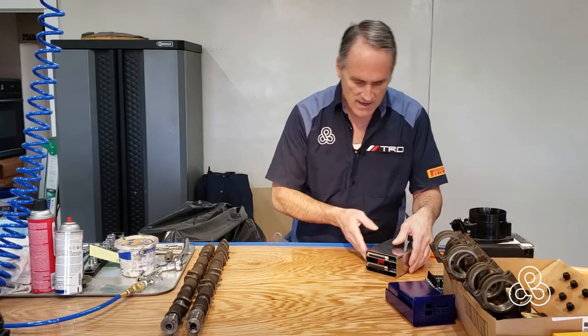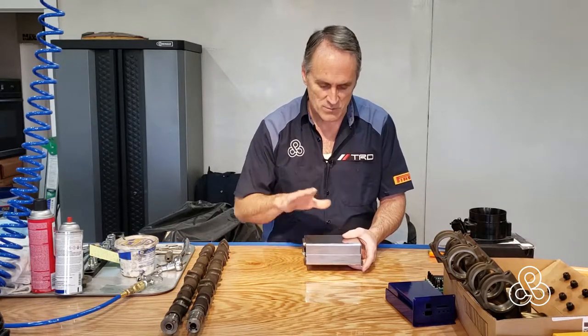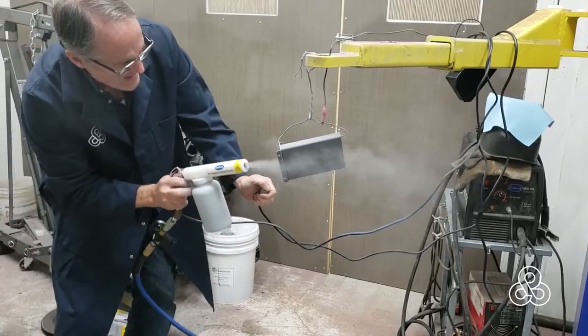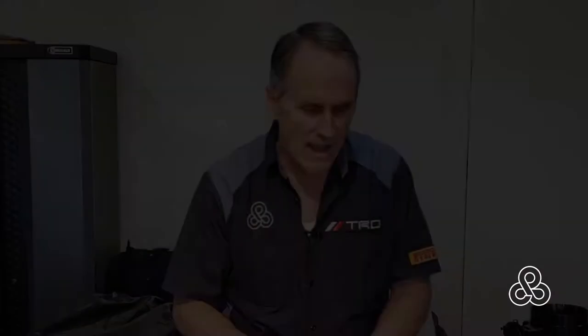So we took that aside, got another case, and thought I would follow the method according to the manufacturer of the powder — which was to put the chrome down and then the blue. But I put the chrome on and liked it so much I thought I would just stay with that. I've learned that the method I should have used is to start baking the powder, get it up to temperature to start melting but not cure completely, then take it out and remove the vinyl. But since I'm still not sure the second layer of powder would have worked, we're going to stick with the chrome.